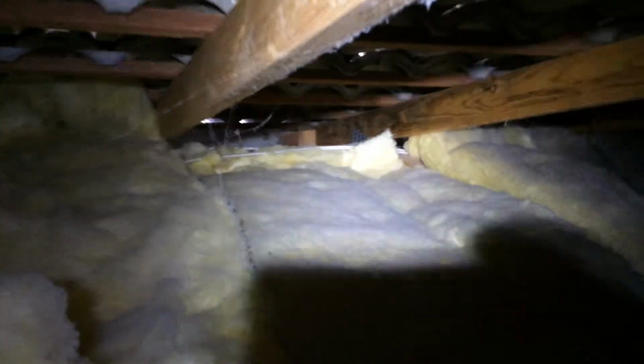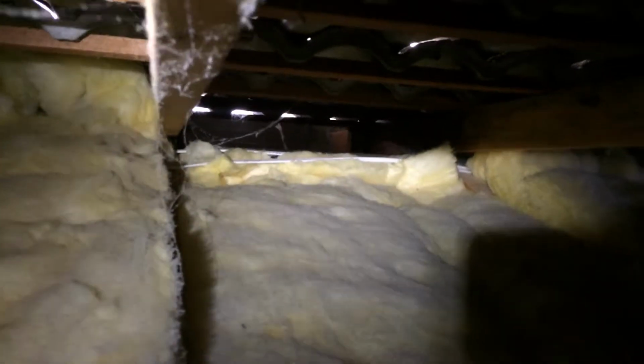And just a second, sorry. I'll just scroll through a little bit more. And you see how the bats are jammed out towards the edges. Well, on that bay there, the bats actually hit the wire, so it hasn't got all the way out to the edge. On this bay here, they've put the bat on top of the wire, so there's actually a big air gap all underneath that bat there in the middle, and so it's not doing its job at all. And this bat here, they've put it down underneath the wire, but then they've left that little corner there, and they've left this big gap here. So this is typical of bat installations for you.